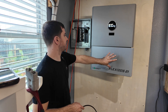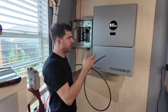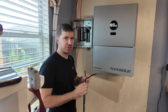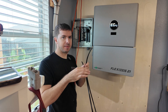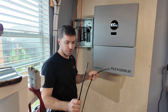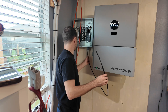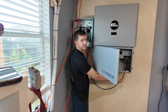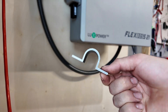To go from the inverter to the breaker box I'm using 4-gauge THHN wire. They recommend 2-gauge wire if you're going to use the 90-amp pass-through, but I'm not, so 4-gauge will be sufficient. The electrical supply place only had black wire - as long as you label your wires with electrical tape to signify your two hots, neutral, and ground, you'll be totally okay. I have three conductors of 4-gauge and one conductor of 8-gauge for the ground. I'm measuring out the wire right now and 3D-printed some conduit holders.